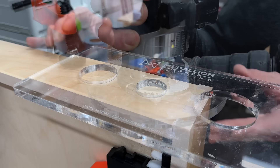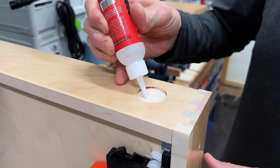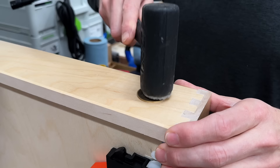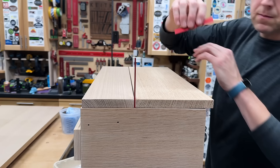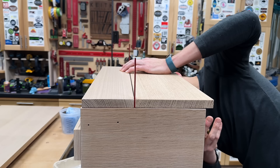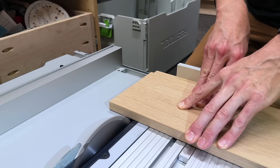And what project would be complete without the Medallion Maker branding coins? These are a super classy touch to add to your work. It's got a little template — you just route out a little recess, a little CA glue, and it's done. There's a link down in the description if you want to glam up your own furniture. Being able to set this cabinet on its back and work on fitting these drawer fronts on a horizontal plane makes it so much easier. I'm just using some 3/32nds inch spacers to get everything where it needs to be, tracing that bottom drawer front, ripping it down to size, and cutting them to length.